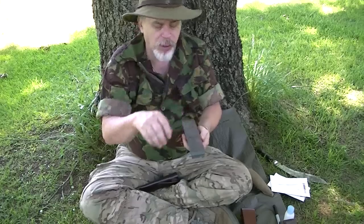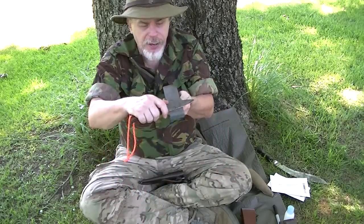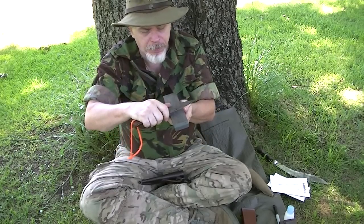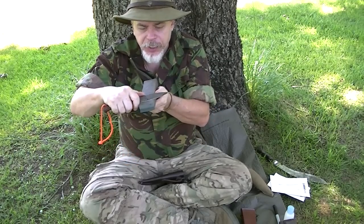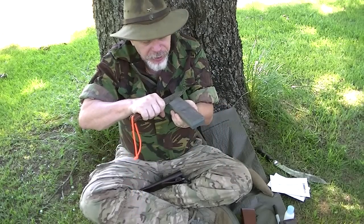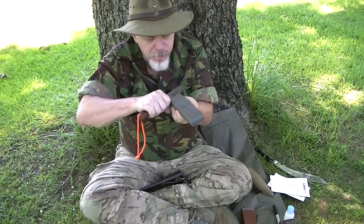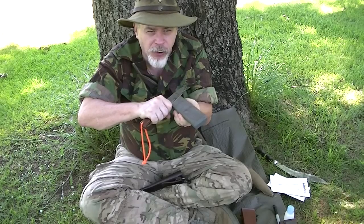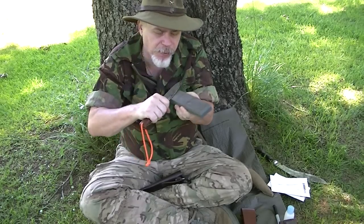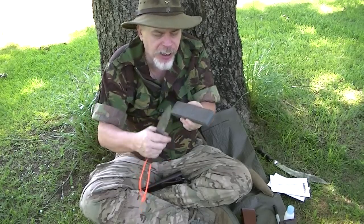Now pull it out of the water, put a little extra on it, and I start my process of maintaining that angle that I had originally. How do you maintain it? Get it up there, and you want to tip the blade downward until the edge is in full contact with your surface. Mentally imagine I'm going to take my knife and slice a paper thin sheet of stone off of that. That's what you want to do. Bear down, make sure that edge is fully on there, the full length. The edge is not way back up the blade, but the edge, there's no gap. And I want to push forward and draw it as if I'm slicing a super thin slice of cheese off of that rock.